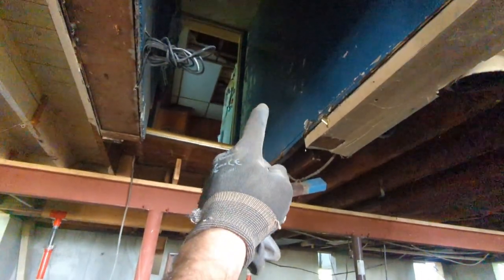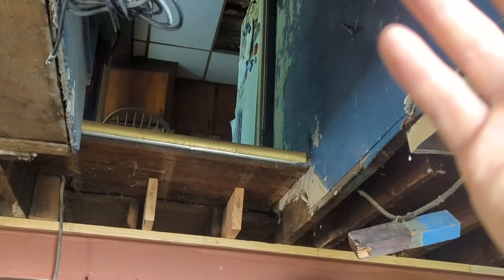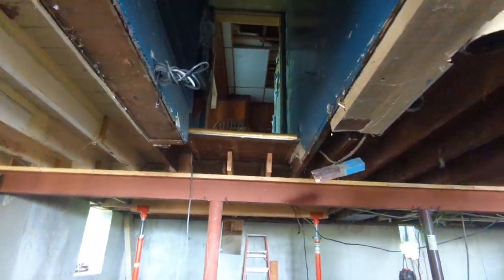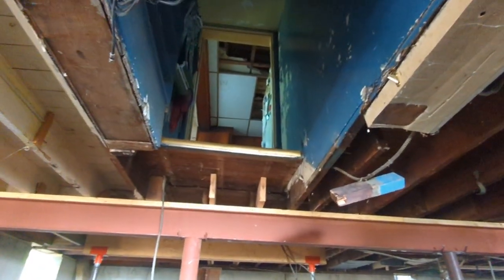As it stands, if you notice the doorway up there, you notice the hinges on that side. You notice the stop, that heavy vertical shadow, because the door was a left-handed in-swinging door to the stairwell. You can't come to the top of the stairs and get knocked backwards by someone throwing the door open in your face. If you have an in-swinging door at the top of the basement stair, you've got to have enough of a landing to provide for the space that the door swings, 36 inches or something they want, I believe.